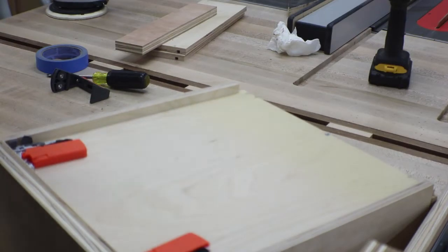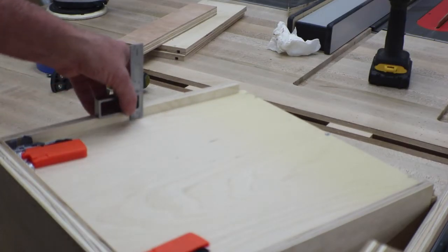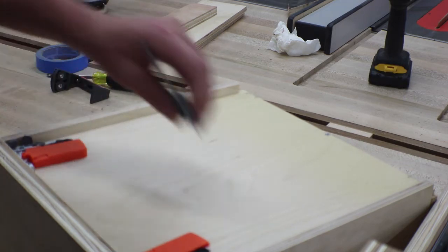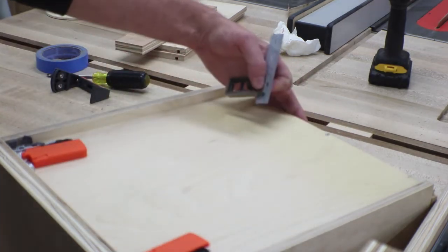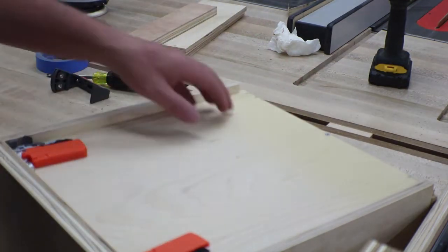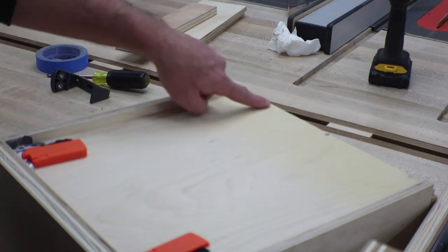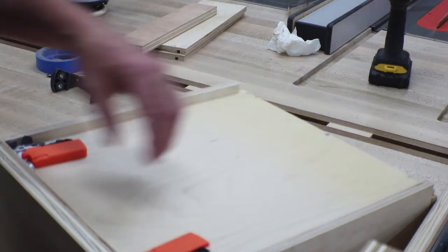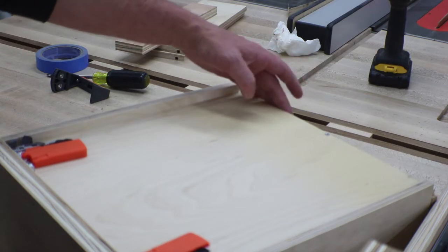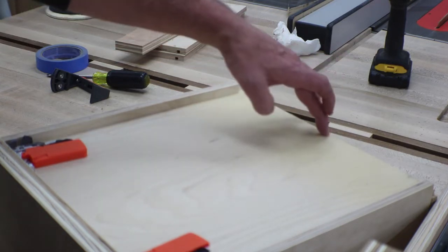So probably one of the most important parts of the drawer construction is to ensure that your rails are a 1/2 inch. As far as what you do on the back, if you want to completely encase the bottom, you can do that, but then you just have to notch out in the corners to allow those rails to go through. I prefer to just cut them off and put a screw in the bottom.